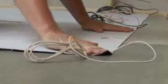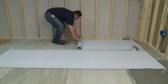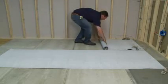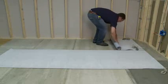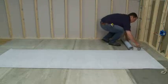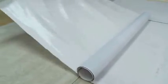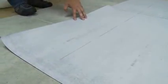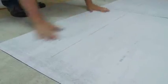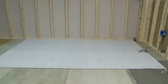3. Press this exposed section of the mat onto the primed surface and then roll the other end back to the point where the release paper was removed. 4. Slowly pull the release liner off and hand smooth the mat into position as it unrolls to achieve a positive bond while avoiding trapping air bubbles.